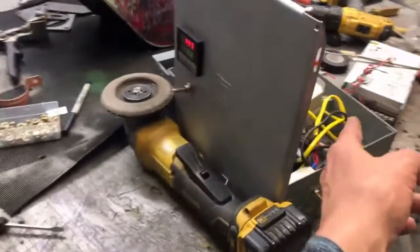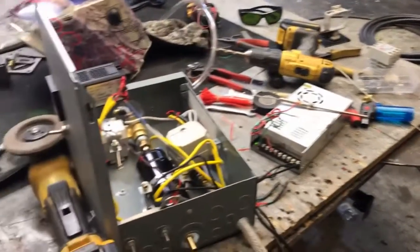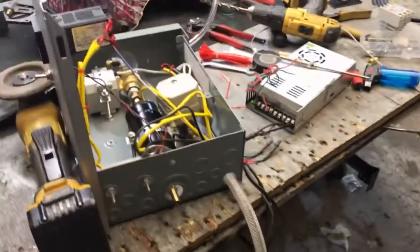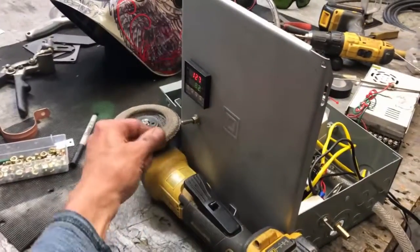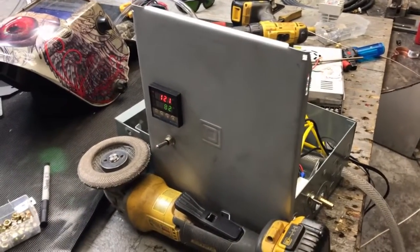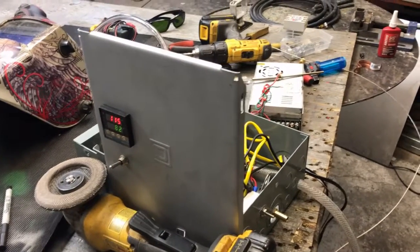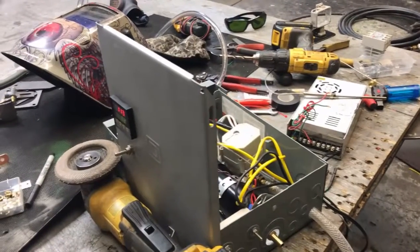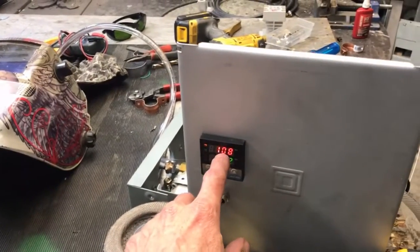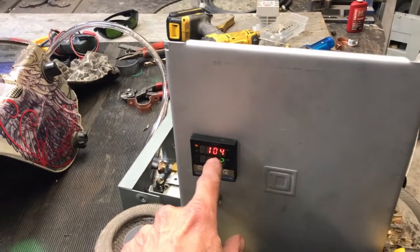Before, these valves wouldn't turn on by themselves when we heated the thermocouple — just in case you're not following, I could get this thing up to a thousand degrees and nothing would happen, none of this stuff would turn back on; you'd have to toggle the jumper switch. Now, when you have this switch turned all the way to the right — that's on — that allows you to fire up the system with the valves opened so there's no trouble during the ignition process. Then once everything gets heated up and this top number stops moving, you set the bottom number about five degrees below that.